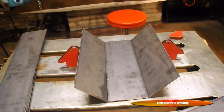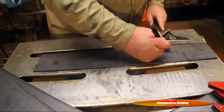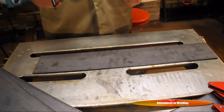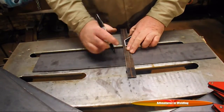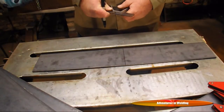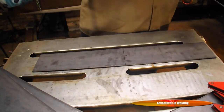All good projects begin with the layout work, so I'm just marking some center lines on this bottom center piece of the grill. I'll mark a couple spots where we're going to drill out for some air holes. The mount for the tailgate support piece is going to be right in the center, so we'll lay that out and mount it up as well. Use a square all the time so your lines are perpendicular and parallel — gives you a nice outcome at the end.